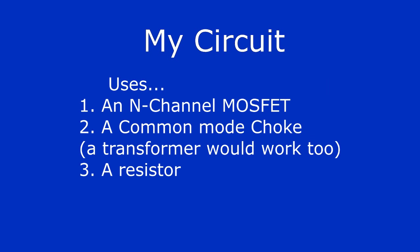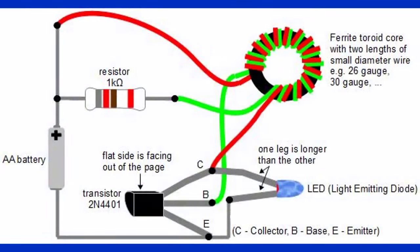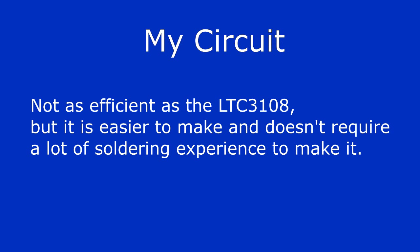Now, my circuit is simple. It uses an N-channel MOSFET, a common mode choke, but a transformer would also work, and a resistor. The circuit is basically a modified Joule Thief, which is essentially a super simple voltage amplification circuit. If you want to know more on how it works, check out the link in the description below.